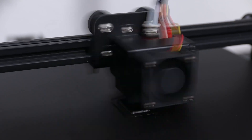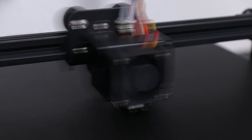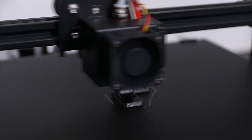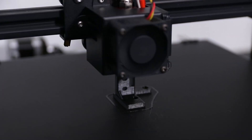You can just have it run at the beginning of your print program and it's going to give you a perfect first layer every time. So let's talk about how to install it. Physically installing it was pretty easy for the CR10 — I just downloaded a model already made from Thingiverse, printed it, and was able to just mount the sensor. Then I had to connect the electronics and I just made some extension cables for the three-pin and two-pin connectors. You can use servo extensions; they will fit perfectly for this and you'll need two of them.